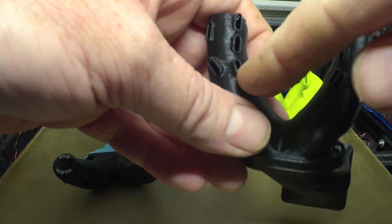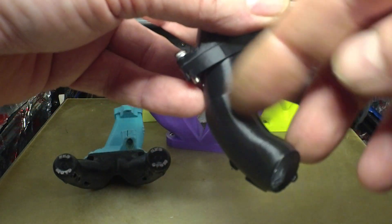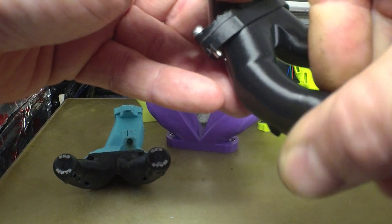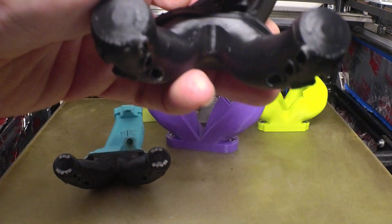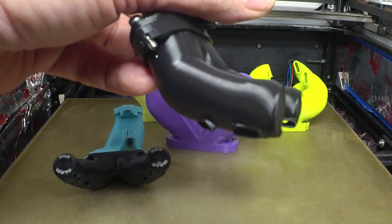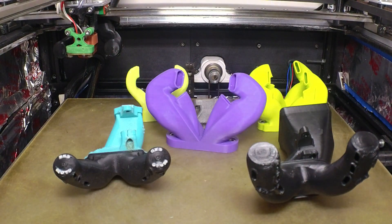I tried making lofts inside here to create curves to direct the holes toward the air, but it actually resulted in less performance. These fingers are large because the more I tried to make them smaller, the worse the airflow was out of the holes — it needed a large volume there to feed off that plenum. Smaller diameter was not better, and even tapering the end didn't help. You'd think tapering would increase airspeed like a garden hose, but that actually gave less air output than the bigger body.